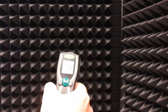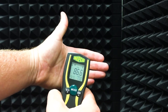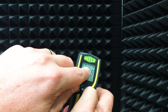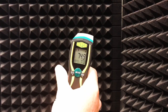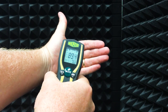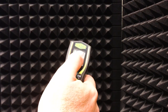To start with, this device has a trigger that you hold in. You can set it so that it works in either an averaging mode, min/max mode, or lock mode. In lock mode it runs constantly, so you can see it's picking up the temperature of my hand even without holding the trigger. If I change it off of lock mode — right here where it says lock — I just hold it down a little bit and it goes back to hold mode, where you hold the trigger and it averages the reading as long as you're holding. As soon as you let go, it locks in the readings. That's typically how you're going to use these.